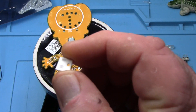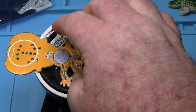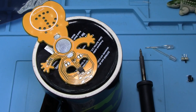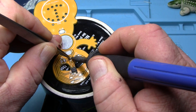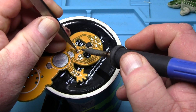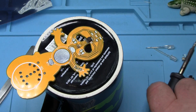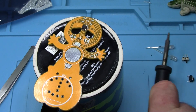Now we're going to get on to the capacitors. I've got the pads tinned, and I just got to get this placed so I can get a hold of it properly. Get her on there. I got one side down - what you want to do is kind of hold the other side when you solder it so it doesn't stand up, which is called tombstoning. I think that was the hard part out of the way - the other stuff shouldn't be so hard.